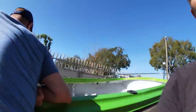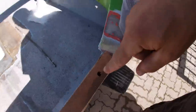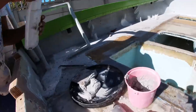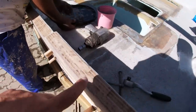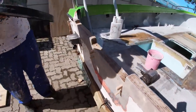So now we're going to start working on the transom. First thing we're going to do is put in a face here and fit that in. We're going to put screws in there to get that new piece in nice and tight, and then we'll figure out what the height of the motors will have to be, and shape and trim it down until we get the right height. That is a paste from grinding dust, resin and hardener. That paste is going to go on the transom now, and then the transom will be screwed on tight. The screws will be taken out later.